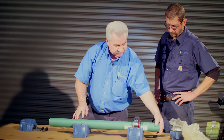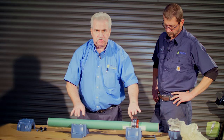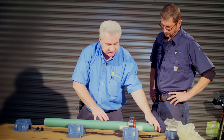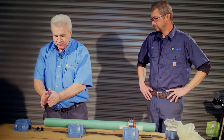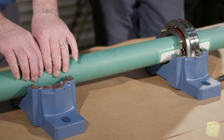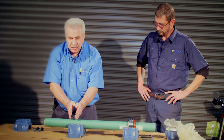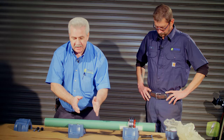This would be our coupling for our motor. We don't want our thermal growth to go towards the motor and mess up the alignment. So locking this with the motor coupling on this end allows the fan or whatever we're going to drive to move to take up the thermal growth. Our bearings are fixed on the shaft journal, tightened here, so the whole shaft is going to move with the bearing. We have over three-eighths of an inch, whatever the width of this spacer is, that it can grow.